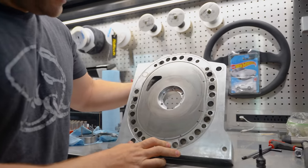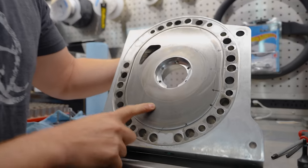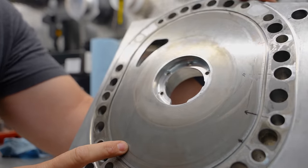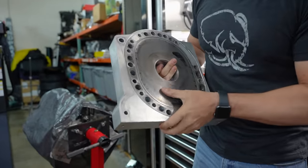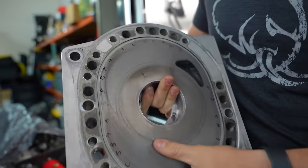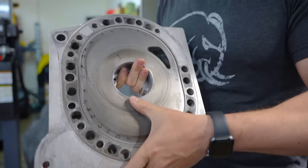The biggest concern is this surface here. So what you see is tungsten cobalt chromium. It's an 86-10-4 combination. I'm giving you guys all of our secrets because we're going to try to make them even better. Very big positives, and there are a couple negatives to this surface. As you can see here, that looks like it's worn. It's actually not, that is built up. That is steel depositing onto the surface of the tungsten cobalt chromium.